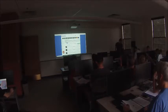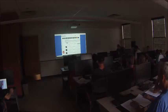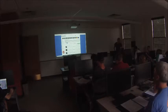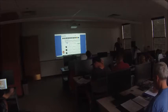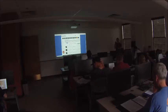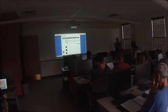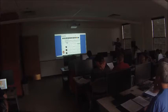Okay, so the last thing I want to talk about was additive manufacturing, because we do use this. The most common additive manufacturing is what most people call 3D printing, right? Additive manufacturing is the generic term. The most common type, the type that we use, is called fused filament fabrication, or FFF for short. Basically, that's where you take a spool of a thin filament of plastic and you force it through a heated nozzle, the plastic melts, and the nozzle, it's a CNC machine, moves around and deposits that plastic in a layer, and then it moves up and deposits another layer on top of that, moves up and creates another layer on top of that.